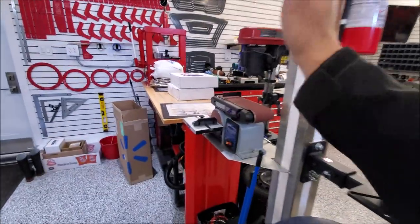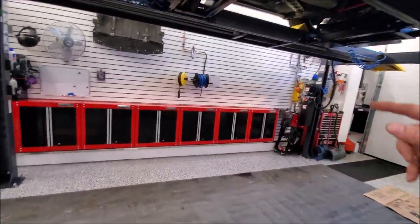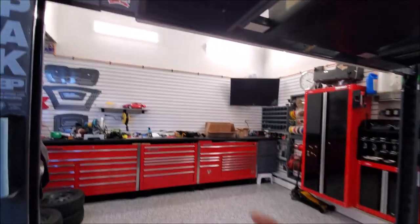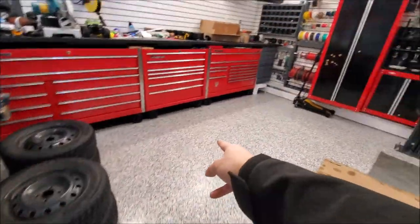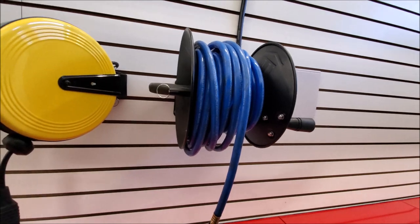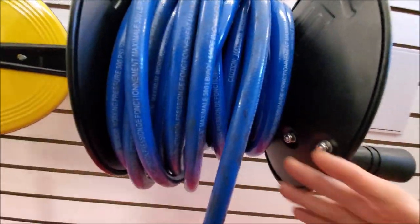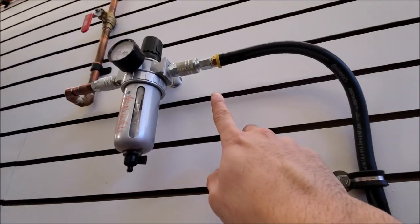With a drop line here, I have an air line near our router table and the counter, and another line servicing the other side of the hoist. If I'm working on a vehicle I grab that one, or this one on this side, and the third one over there for outside. You could add another drop if needed, but I can always drag a line over — that's a bit overkill. Honestly, I really prefer simple hand-rolling reels like this. Drop-down reels are spring-loaded with more parts that can go wrong. Since this is my go-to, I want it simple and easy to change out — just shut off the line, disconnect from the quick release, and it's threaded in.